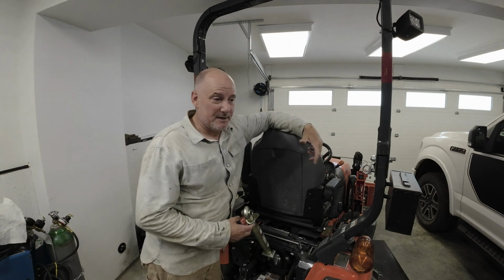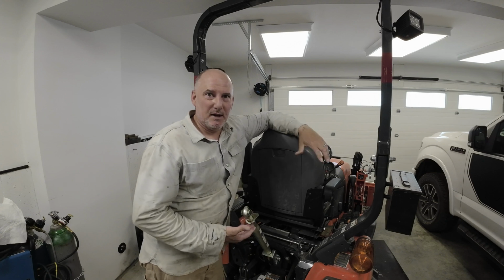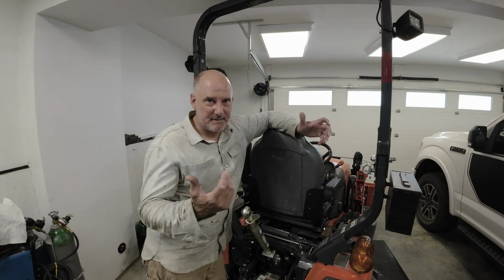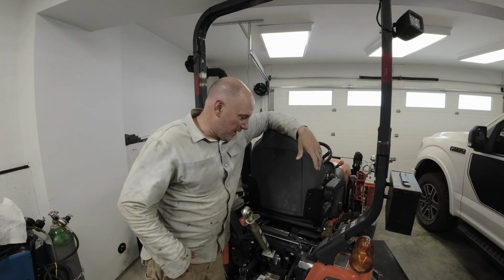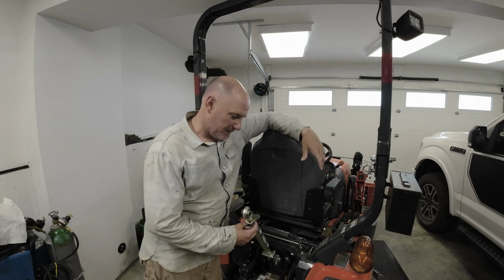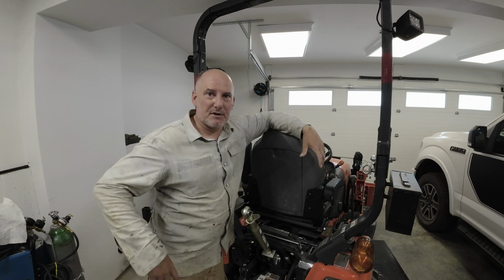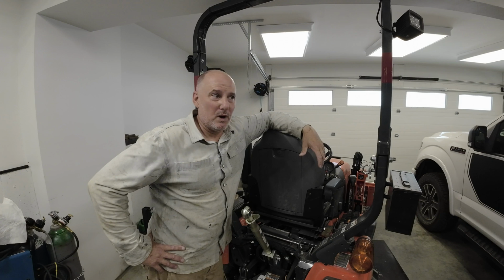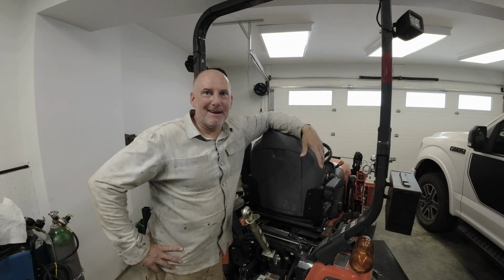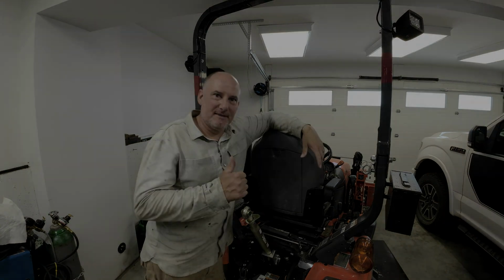For whatever reason, I forgot and didn't thread it down. It was right at the top where it is now. When I lifted the box blade, it hit that pin and bent this, and we're where we're at. So we've got to either fix it or cut it off anyway and come up with another game plan to hold this collar from turning itself off and adjusting itself while we're using the box blade or the push cutter. Anyway, that's the game plan. Thanks for stopping by, and let's get started.